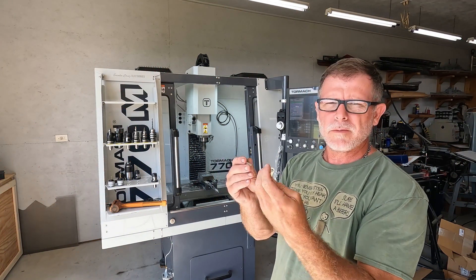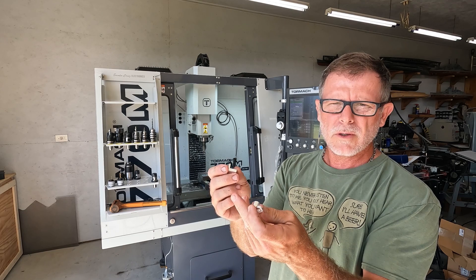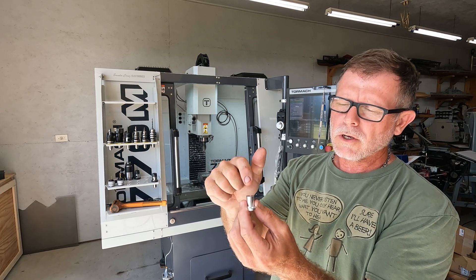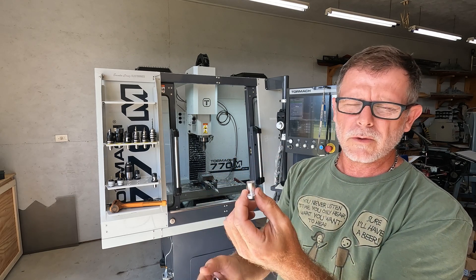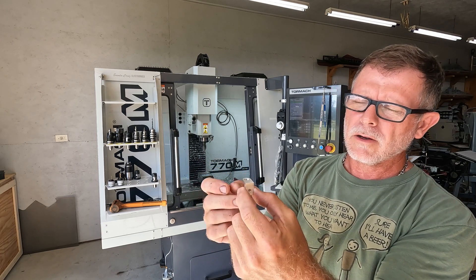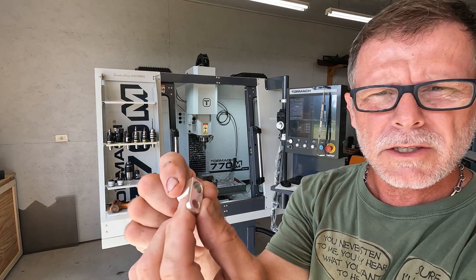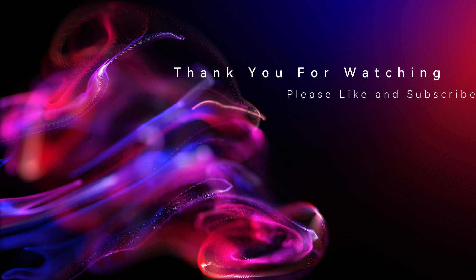We got them all done. These are by far the smallest parts to date. These are for the proximity sensors to mount on. One is for the rotation — you'll remember from the earlier episode there was a notch cut in the bottom, and that's for this to sit up in there, with a hole drilled through it to pass the wire. This one is to be mounted on the back of the rail bearing plate to mount the next proximity sensor for the flag to go over right there. These parts came out really nice. Anyways, that's it for this episode — please like and subscribe and we'll work on the next project. Thanks.